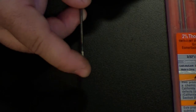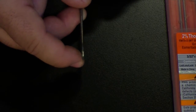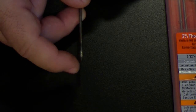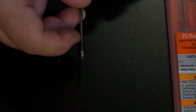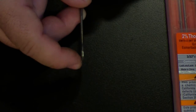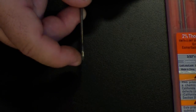There are times you may want to truncate the point just a little bit by taking off a very small amount of material off the end of the tungsten, particularly when you're welding at high amperages. That prevents a piece of the tungsten from flying off down into the weld. With lower amperages and the proper size tungsten you really don't need much truncation. When welding AC on aluminum, this point is going to naturally dome a little bit — that's fine. But if you've got a big round ball on the end, you've got too much cleaning action.